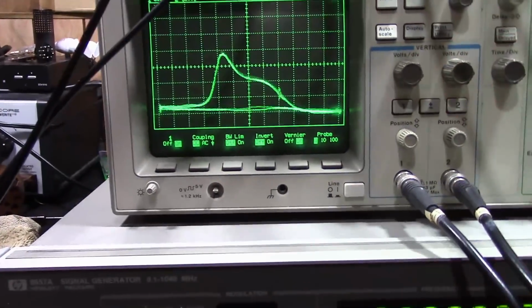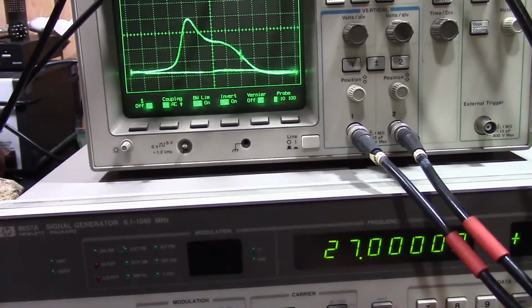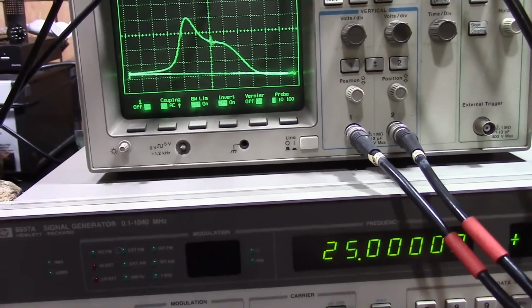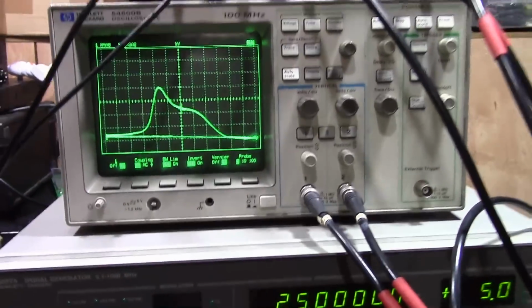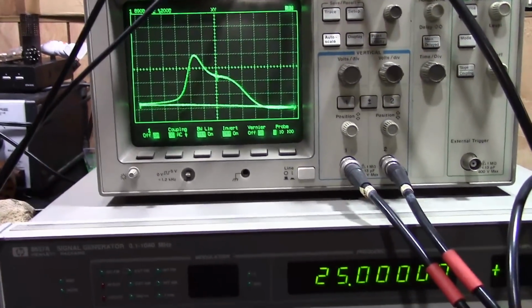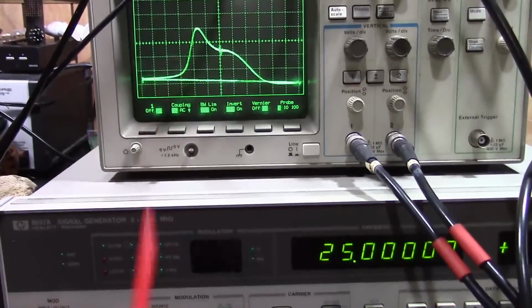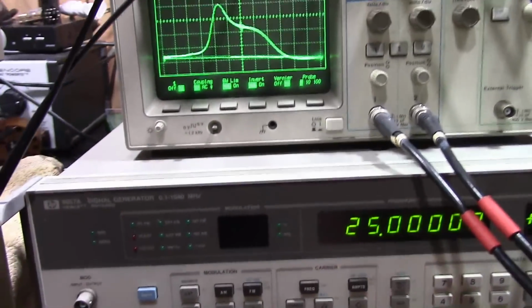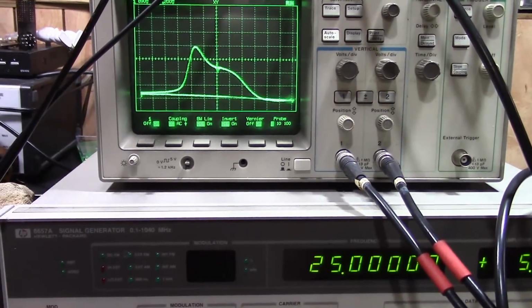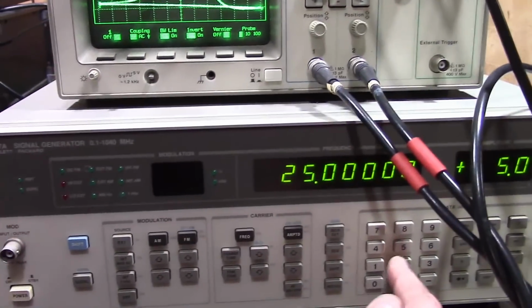I'm not sure why things got all kind of weirdly modulated there. It's back on 20. Huh. They mentioned on here that as you're peaking this, you can get things into a kind of self-resonating state where you start getting some feedback, and that might be what I've got going on here. I can throw in a 1000 picofarad cap between a couple points to try to eliminate that.